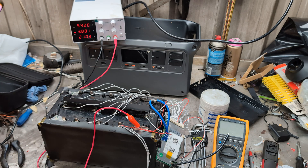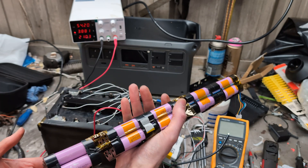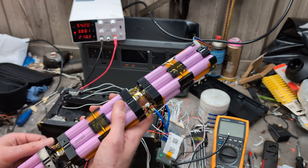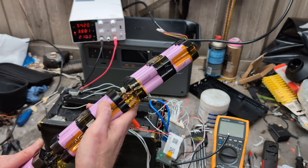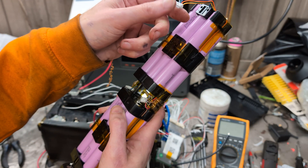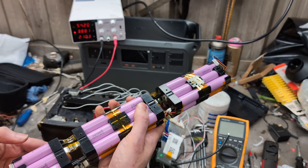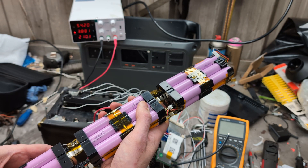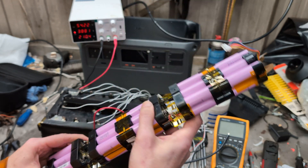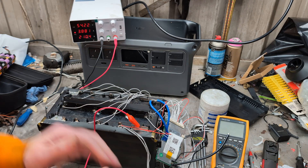The only other question I had is about this dead battery from my e-bike, which I've now taken apart. As far as I can tell, it is a nine-cell pack — three on the little plug and the other six on this other plug at the back, which adds up to nine. So I need to find a nine-cell BMS for these — they're 36 volt batteries and they're all Samsung cells. Then I can make another pack for a 36 volt e-bike and have an add-on battery.